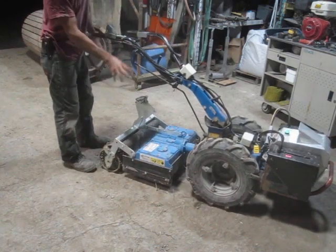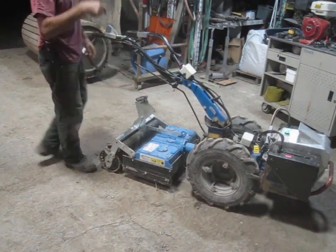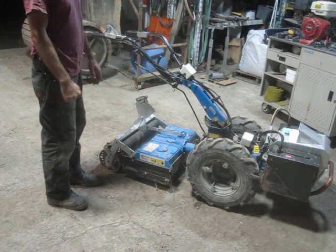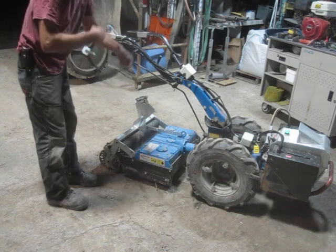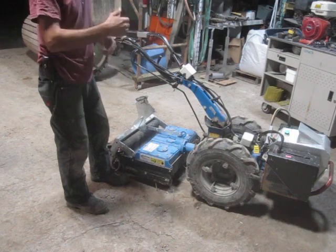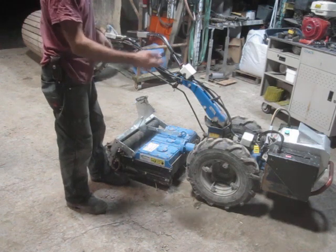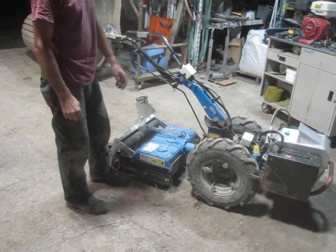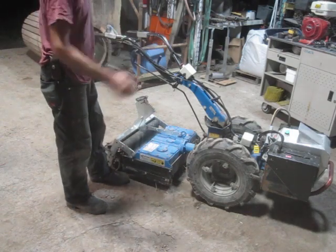The mechanical transmission of the BCS is unchanged and the ratio of power delivery to the tool on the PTO is the same as it was before, so in second gear the tilling implement or mower goes much more slowly per wheel turn. In first gear you get much more aggressive PTO action per unit of travel.